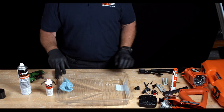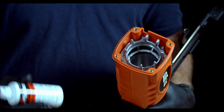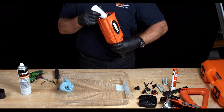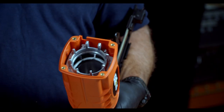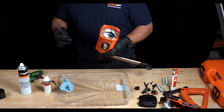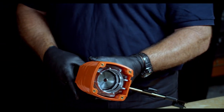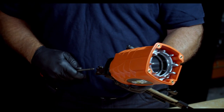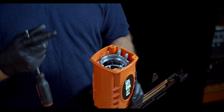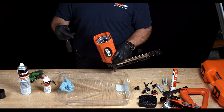Step three, we're ready to lubricate the tool. Pick up the cylinder assembly. First, drop the impulse oil around the inside of the cylinder, trying to get a full circle of oil all the way around. Get your screwdriver and use it to depress the firing pin, which pushes the piston to the back or down position. Then use the screwdriver to push the piston forward again. Repeat this several times to distribute the lubricant — this creates a ring of oil around the cylinder and gets oil to the steel O-rings around the piston.